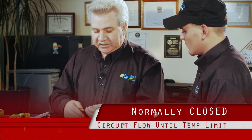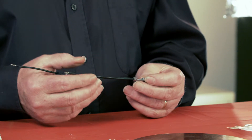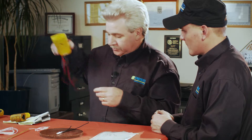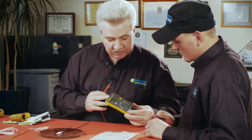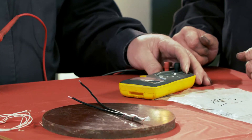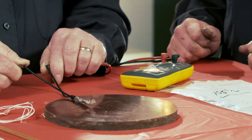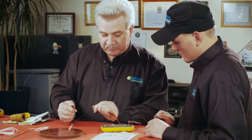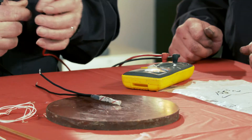These come in a normally closed or a normally open position. When a motor comes in, you need to put an ohmmeter across the leads — put it on ohms, short out the two leads and you should get roughly zero. When we put it across the thermal protector, we're looking for either normally open or normally closed. On this one right now it's showing basically shorted closed, at about 0.1 — just the resistance of the small piece of copper.